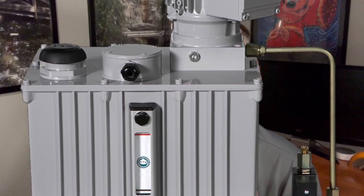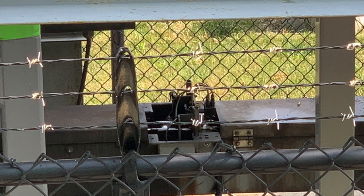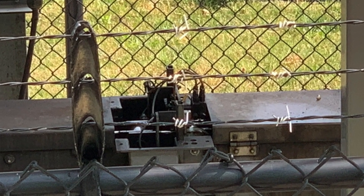If you've seen my episode on grease, then you already know where I'm going with the next one. A lot of lift hills use oiling mechanisms called automatic oilers. They sit there and they pump oil onto the chain at predetermined times from typically all angles, and they make that chain nice and oily. Are all rides required to have them to oil the chain? Because oil is completely necessary to keep this running. But are they required to have them? No, they're not. Is it a nice thing? Yes, it's a nice thing. But you can always send a mechanic out there and oil the chain manually.